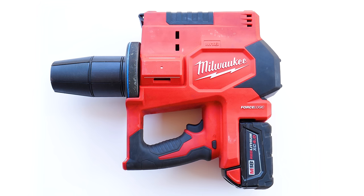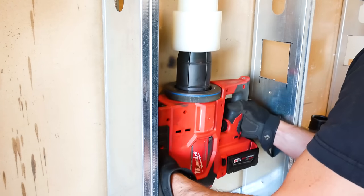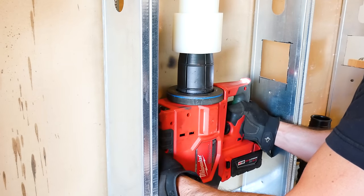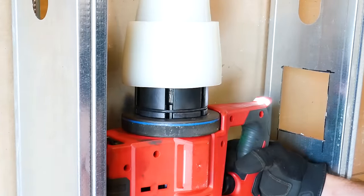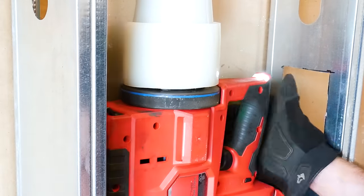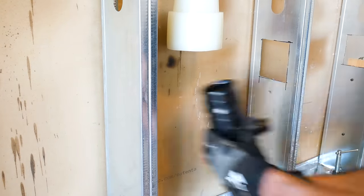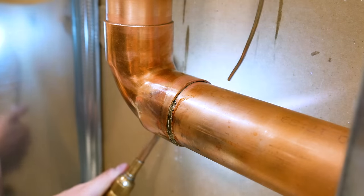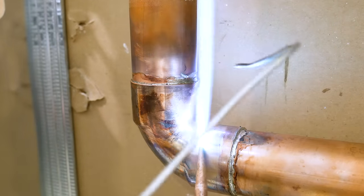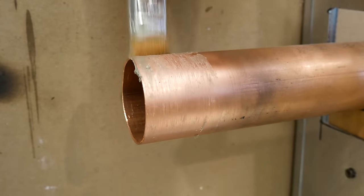Now, you guys have been waiting long enough. This is the Force Logic Expander, and it could expand from 2-inch to a whopping 3-inch — that's totally insane. The Force Logic, unlike the two other models, will expand automatically after the trigger has been pressed. It's just amazing that we're able to expand to this diameter in such little time with no flames, no chemicals, and with minimal effort. Once it's fully expanded, just insert and you're done. I've soldered quite a lot of 2-inch and 3-inch copper joints in my career, and with this tool it's quicker, easier, and so much simpler. You'd normally need to deburr, sand, and flux the pipe before actually soldering — with this, none of that is needed.